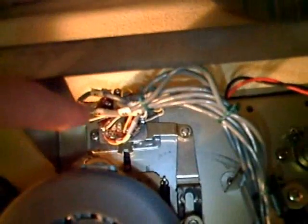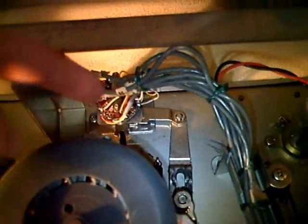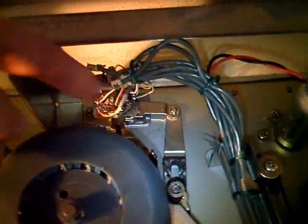And look at this. This is the speed selector, and of course all the things, the equalization and the bias for the different speeds. It's a switch for all of that. So really a bunch of shielded cables are going to that switch. And as you can see, for additional shielding, they are also in this thing right here, going down until here, into this big mess.